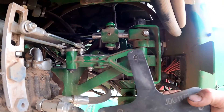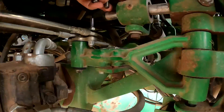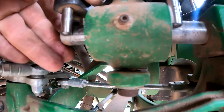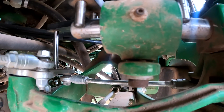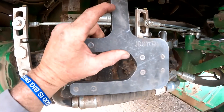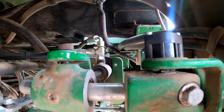To calibrate these two sensors you have to have this special tool. What this tool does is we mount it up in this area — it pins into that arm there and also pins around the cylinder here, keeping this steering mechanism in a center position during calibration. There are a couple different calibrations for that in Service Advisor, but you do have to have this special tool to run the calibration on that position sensor.